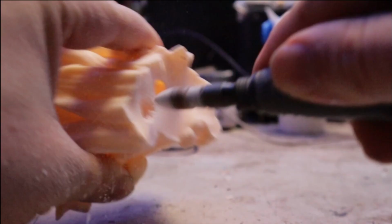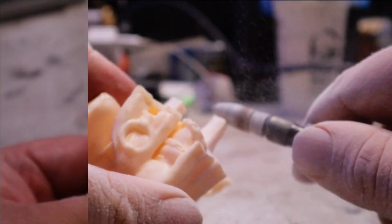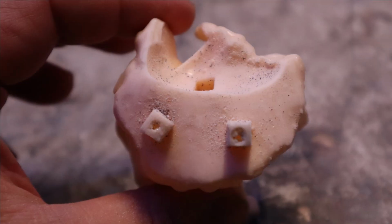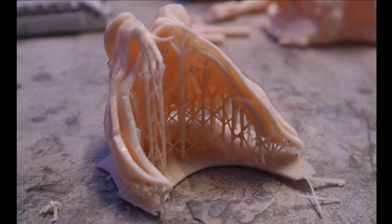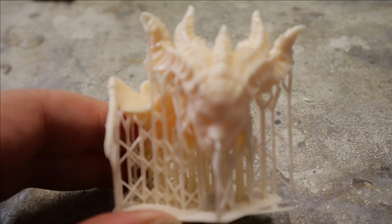I also find some prints with shifts and too fine of a tolerance do not snap fit together the best. These holes and pegs are widened and shortened with a Dremel tool. Nowadays I also use the Dremel to flatten any surface that the supports have been ripped off, to save a lot more time than using a knife and sanding.